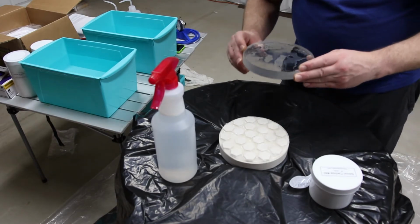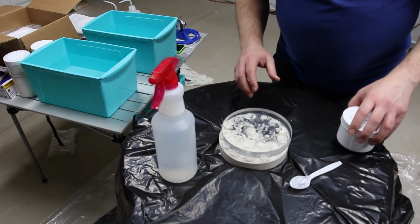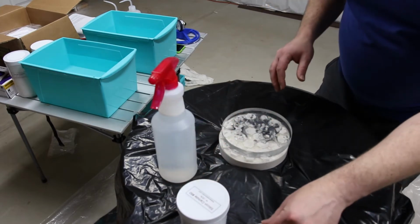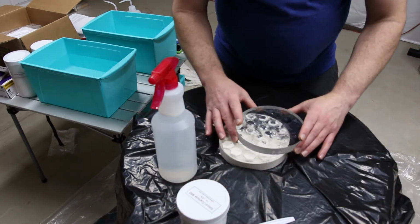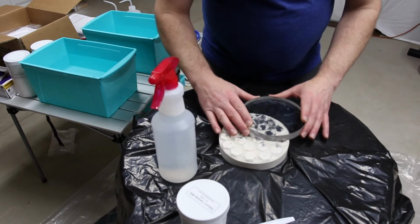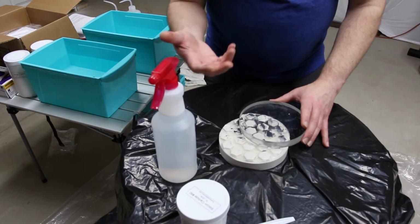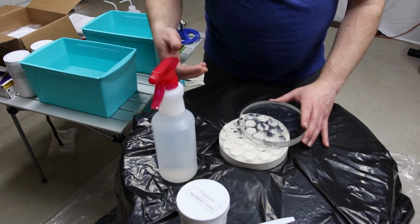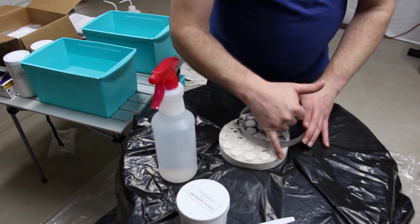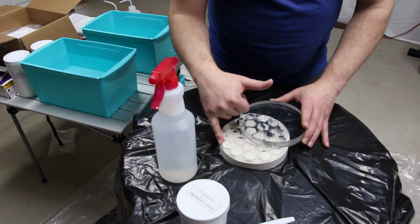And here we go. So to begin, my understanding is we need to use what are called chordal strokes. Now, a chordal stroke basically means that I'm going to move my mirror closer to the edge here, and then I'm just going to move this back and forth this way. And a chord, in terms of math or geometry, is where you have an arc and you take one point on one side and one point on the other.